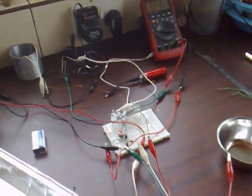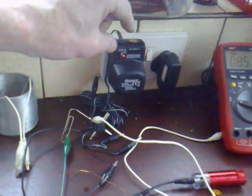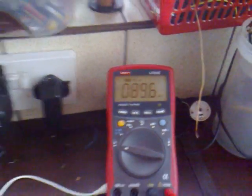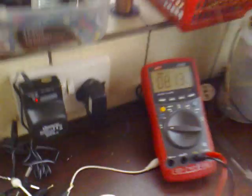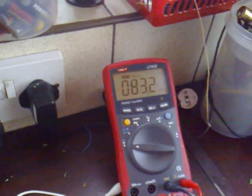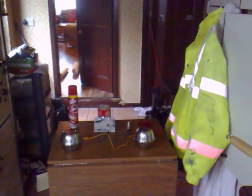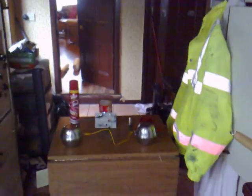Now I'll up the voltage a bit — I'll put it onto 12 volts, which is its full setting, and that's drawing 89 milliamps — actually 81 now I've taken the transmitter off the worktop. That must be well over two metres away. I'm getting really good wireless performance from this now.